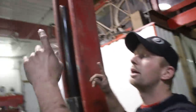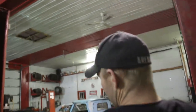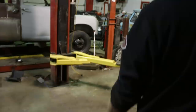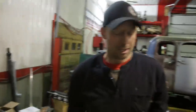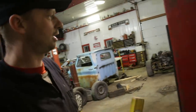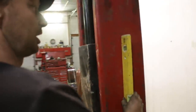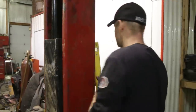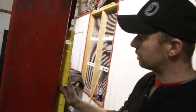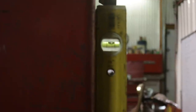We also want to measure the distance between the tops and do the same distance at the bottom. Then grab a level — preferably a four-foot. My Stabila four-foot died a while ago, but my two-foot's pretty good. We want to make sure it's nice and level. We've got to go a bit that way — we'll hit it with a sledge. And we need to bang the bottom in just a hair.